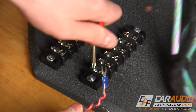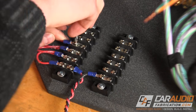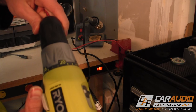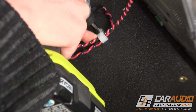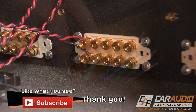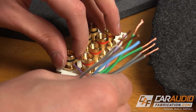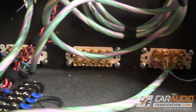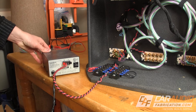I'm screwing down some terminal strips, which I'll use for a direct connection to my 12-volt power supply to power the radio, amplifier, and also to power some of the binding posts on the front so I can easily connect 12-volt power for whatever aftermarket device I want to test. For the power connections, I make twisted cable using red and black primary wire and a drill. I use plastic wire restraints to keep things tidy on the back side of the panel, and to connect the wires to the binding posts, I unscrew them and tighten them upon a stripped end of wire. For power, I'm using a 12-volt power supply. Now let's fire everything up.